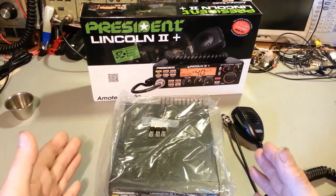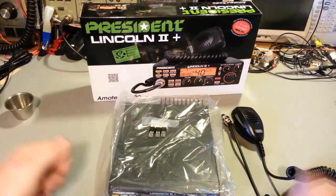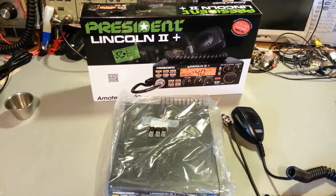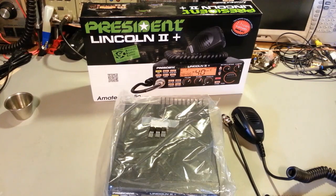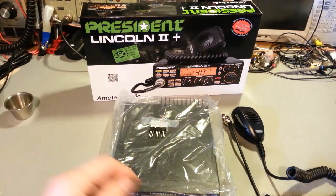So just a word to the wise — that's what this video is about: proper handling and transportation of static-sensitive semiconductors. Everything is wrong with this picture. I can't fault the customer if they don't know — if you don't know, you don't know, but now you will. When you're handling MOSFETs, please be very careful. It's not just transistors either — integrated circuits, especially TTL and CMOS, are very static sensitive. It doesn't take much, just a rustling of a plastic bag, and poof, it's gone.